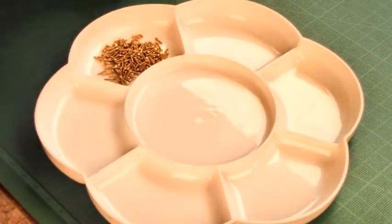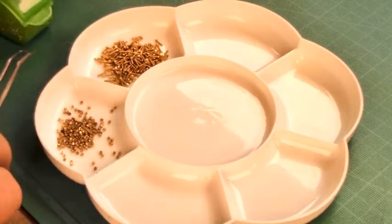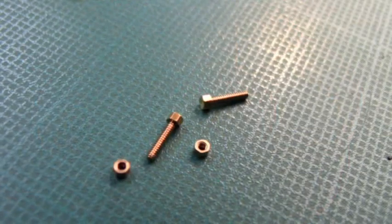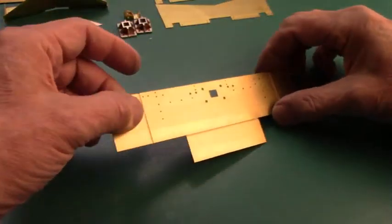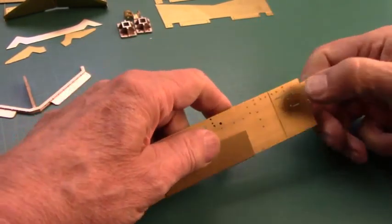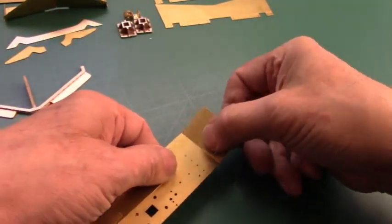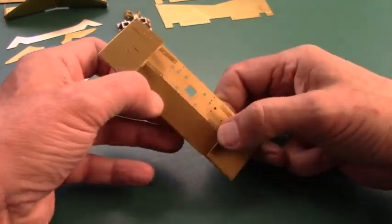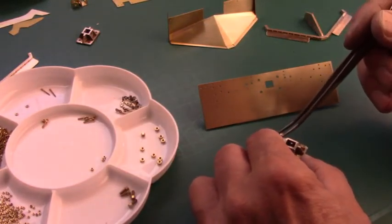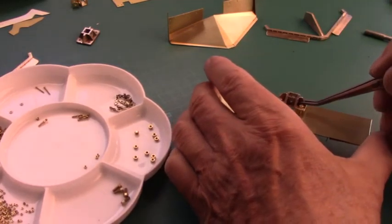The 1-inch screws used in the original correspond in the scale of 1 to 22.5 very exactly to the M1 screws used in the model. According to the original, they have tall, slim, hexagonal heads. Only the buffer shaft is fixed with 4 pieces M2. Later, for painting, however, it is dismantled again.